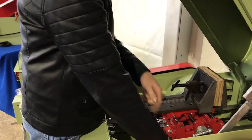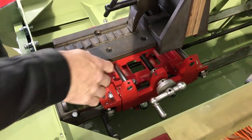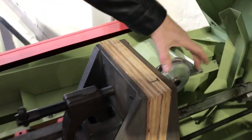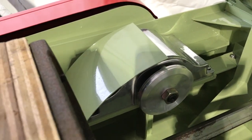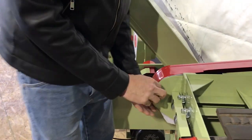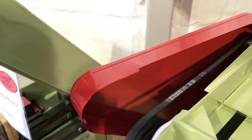The feed drive is controlled right here — this is your feed handle. The first thing you want to do is take this nut off. We ship this with a little bit of tension to keep the flanges from coming loose. So what I do is undo this little screw right here on your belt guard, pop it open, and you're going to see your pulley.